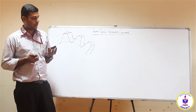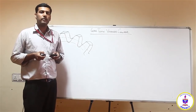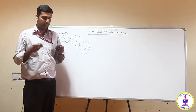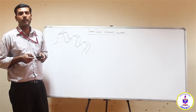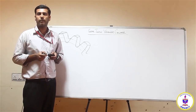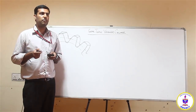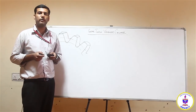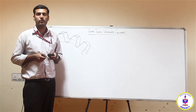One of the main reasons you use a gear, other than the other transmissions discussed earlier, is simply because of its ability to transfer a lot of power in a very small area. A lot of power means a huge value of torque. That can be basically 2 Newton meters starting from, and maybe the transmission drive of a two-wheeler of 5 to 10 Newton meters, going to heavy cars, for example a Maruti 800 at 50 to 100 Newton meters, Ferraris at 500 Newton meters, and some cars and trucks which transfer higher torque up to 1000 Newton meters.